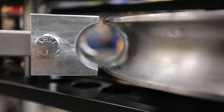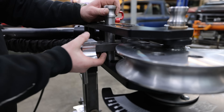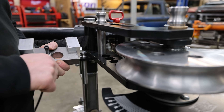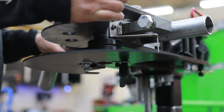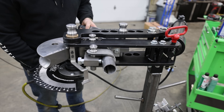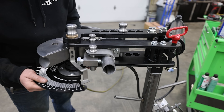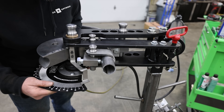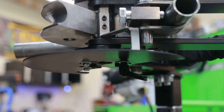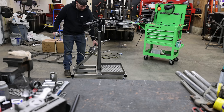I'm ready to throw a piece of scrap in and make our first bend, but first I need to make sure the dies are in alignment — this just takes an eyeball. I thread this bolt in or out to raise or lower the die, then lock the jam nut in place. We put a piece of tube in and set the degree wheel. I slowly put tension on the tube and wiggle it up and down to see if it's still loose; once it's firm and the machine is about to bend, I loosen the knob on the bottom of the degree wheel, slide it to zero, and tighten it back up. I'm going to bend to 48 degrees to account for spring-back and end up with a 45-degree bend.